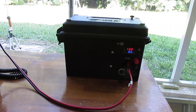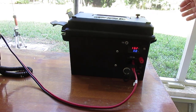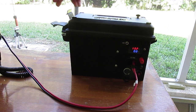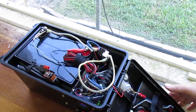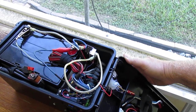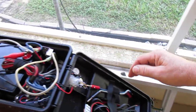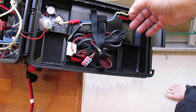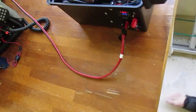Let's go take a look at the battery box really quick. There's a low power alarm on the battery box too — it's just an LED and an alarm, with an adjustment here. Right here is a battery at 8.8 volts that I use as a reference — I take the alligator clips off, connect them, and adjust my low battery alarm so I know when it gets down to 8.8 volts it's going to go off. This is a 12-volt, 35 amp-hour battery. There's the low battery alarm. We have some cables over here — light adapter cables, including a kind of universal one. It's all self-contained in this box — carry it anywhere.